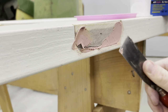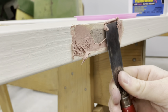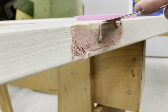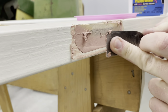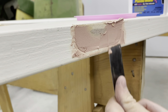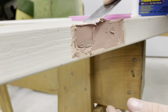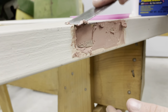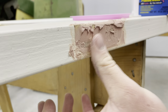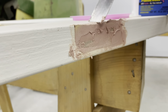This is an important step for making these old door hinge grooves disappear. This wood filler is some pretty cool stuff — it goes on pink and when it's dried it will be a tan or pine wood color. It's pretty easy to work with, just takes a little time to get everything transitioning how you want it. I would add more wood filler than you need in this step, overlapping it onto the part of the door that doesn't need any at all. This stuff sands so easy, and if you have any extra you'll be able to get the transition you want very easily. I just used a small putty knife to apply the wood filler and made sure all the gaps were filled. I repeated this process three times for all three door hinges.